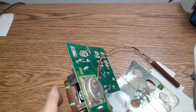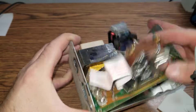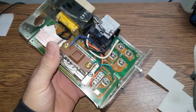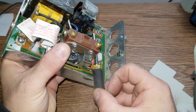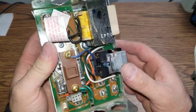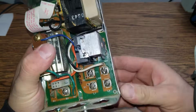Temporarily, if you want to make the Aquastat work again, you can do this: basically take a wire nut or something and push it here against the connector to press it down. It will probably make it work, but it's only temporary — it can't be permanently fixed.